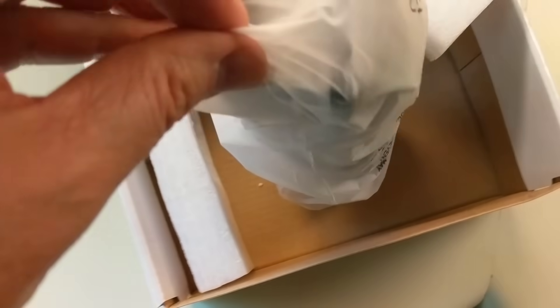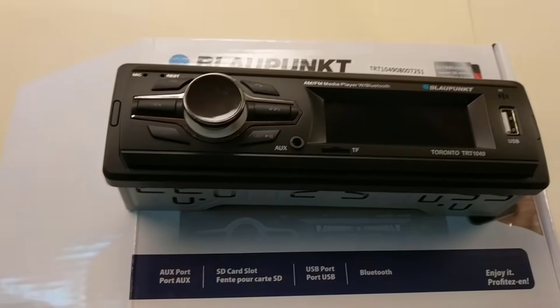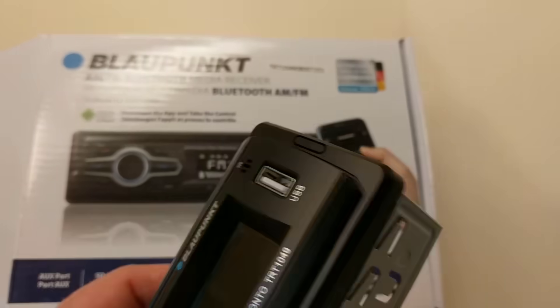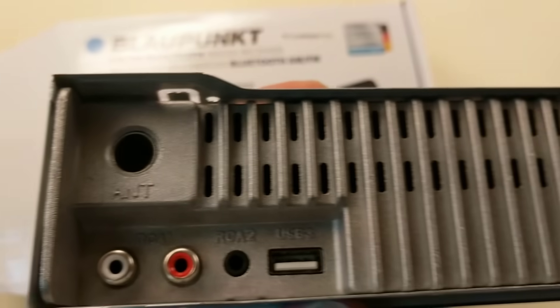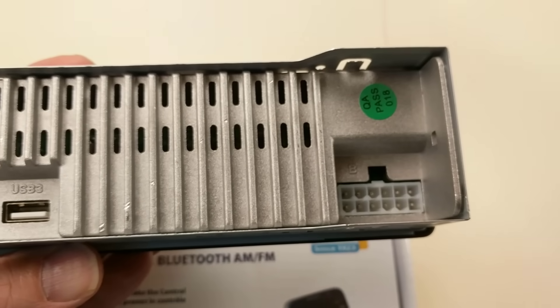Let's start by examining the wiring used in a car audio situation. Most aftermarket car stereo head units use standard color-coded wiring for speakers and power connections, and they typically have RCA style preamp outputs. There may be as many as three pairs for front, rear, and subwoofer. This inexpensive model only has one pair of RCA preamp outputs.